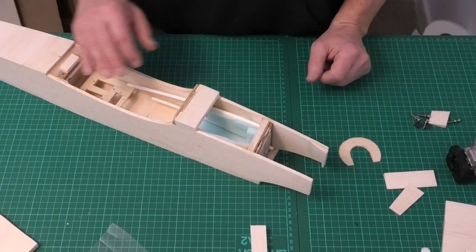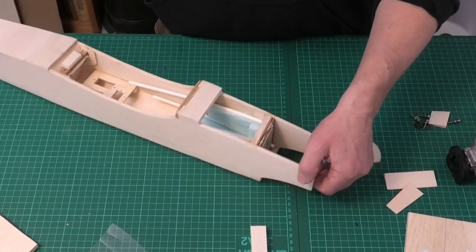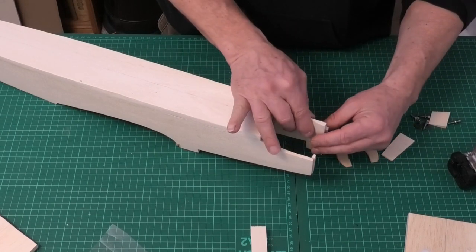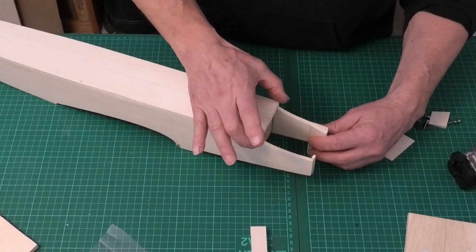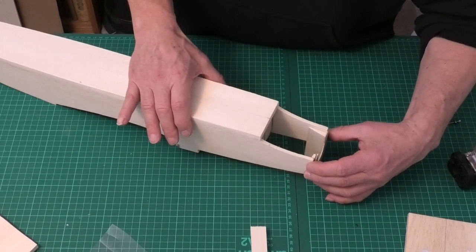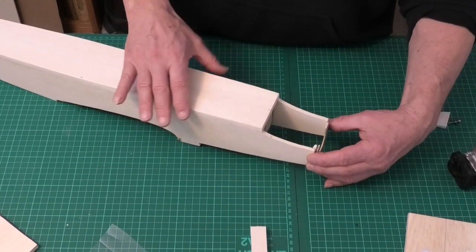Now I want to move on to the front. I have a piece of sheeting ready for the underside which I've epoxied to fuel-proof. But before I start on that, I want to build up the engine bay. There are some 3/32nd pieces that go on the sides to thicken them up, and some leading edge triangular tapered stock that goes on the front as well. I've also got a 1.5mm plywood nose ring going on the front. These sides may have to come in a little bit, so I'm leaving the underside sheeting until last.